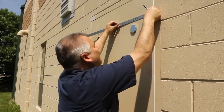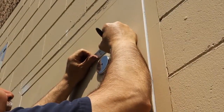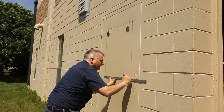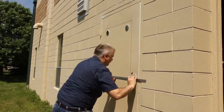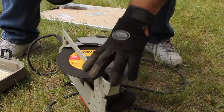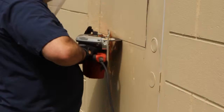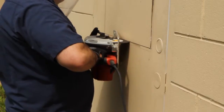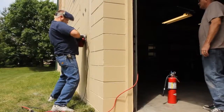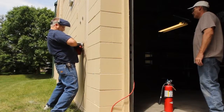Now as a caution, make sure you leave clearance for the door closer, panic opener, and kick plate before you make a cut on the door. Using the circular saw, cut an opening half inch smaller than the marks. Have a second person on the other side of the door with the fire extinguisher close by as a fire watcher to make sure no sparks ignite.